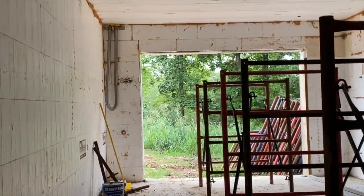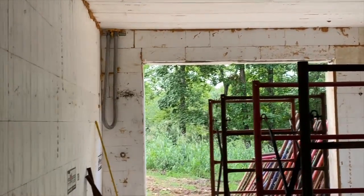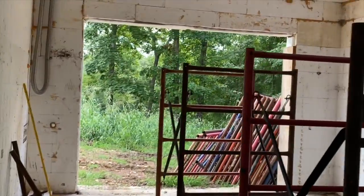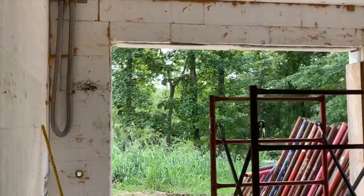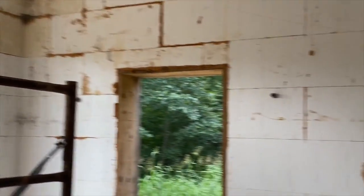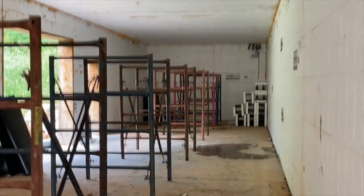The concrete, when we pour it, is going to weigh somewhere between 66 and 70 pounds per square foot for the insulated deck, the beams and the slab combined. It's very rigid up there, but we don't want it to deflect or do anything that might cause a crack. It's all good. But interestingly, the roof up there is going to be home to a bunch of solar panels, and this is the battery room.